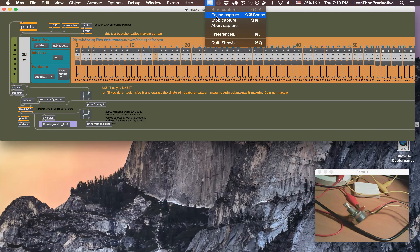So for pin 14, we go to analog in. For some reason it seems to be affecting a different one — I'm not sure why it doesn't correspond exactly. But as you'll see, when I move the potentiometer, it does move on the Maxuino patch. You'll also notice it's heating up a little, so it might be worth putting a resistor in to keep it cool, or something to dissipate the heat on the back. But that's how you do it — I hope it's helpful.